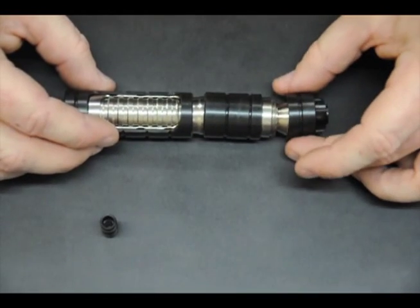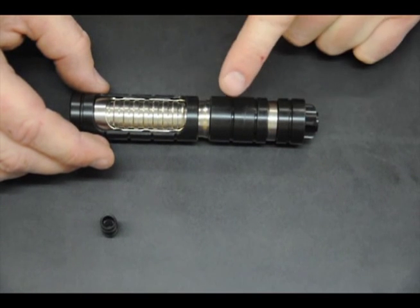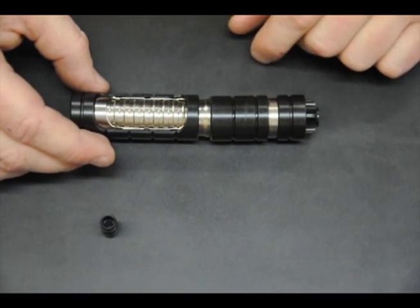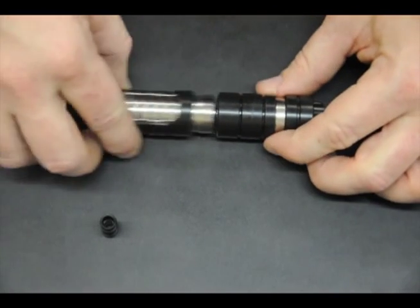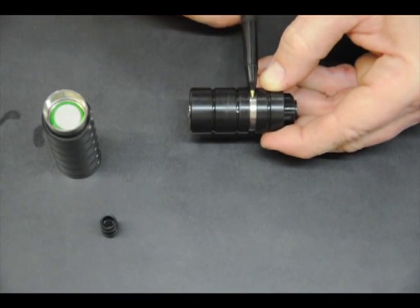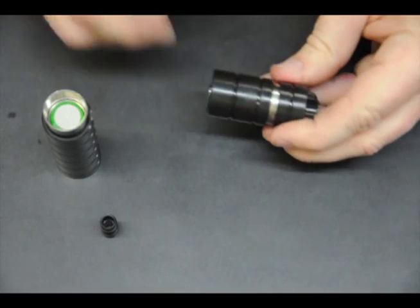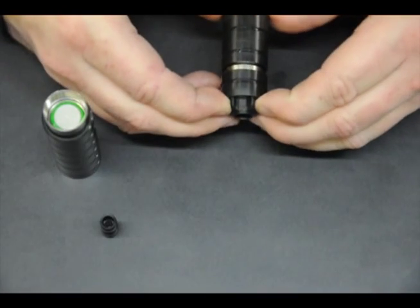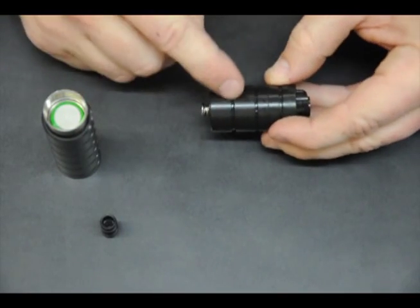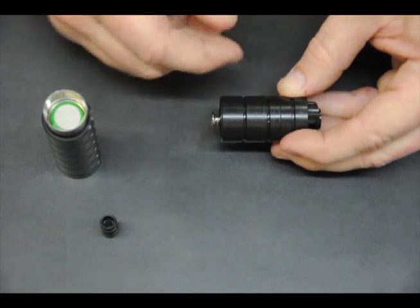The next step requires an awareness of the position of all the Delrin sleeves. The cap that threads on first will determine the position of the middle Delrin sleeve, which then in turn determines the position of the lower Delrin sleeve. It's a one-two-three positioning sequence. The beginning of that sequence would consist of threading the cap on. Note that there's a gap here — I intentionally left that gap by only pushing the middle Delrin sleeve on about three-eighths of an inch. With the cap threaded on, we now know the final position of the middle Delrin sleeve, and we achieve that just by pushing it all the way up until the gap is closed. Clocking here doesn't matter — the counterbore and the Delrin sleeve provide a radial gap such that air can come in the holes irrelevant of the clocking position.